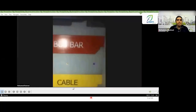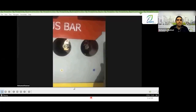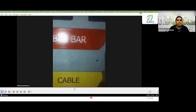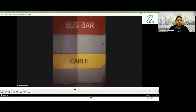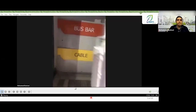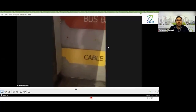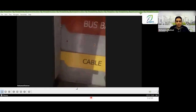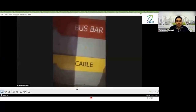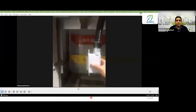And I have the second shutter door, which is the part related to the bus bar side. And of course, we know the benefit of the shutter door, as Engineer Ahmed mentioned, for maintenance purposes. Like now, when we take the circuit breaker out for maintenance, any operator working inside during maintenance should not accidentally have their tools, hand, or anything come close to the area here, which could cause an electrical shock. And this is the complete housing of the circuit breaker, and this is the handle.